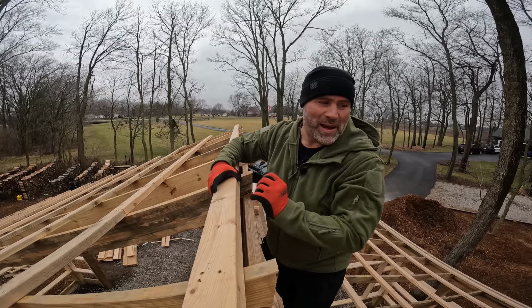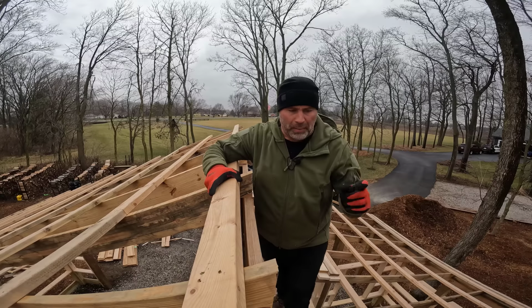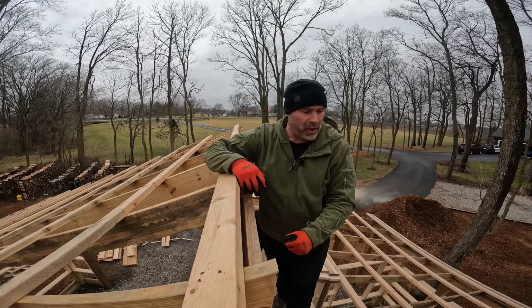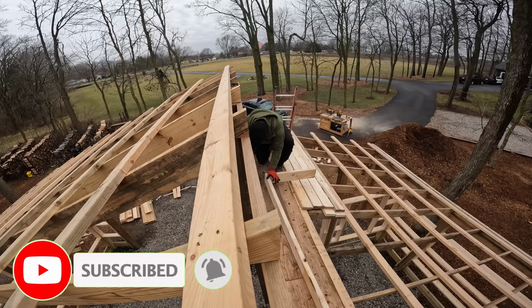Okay, I wanted to switch things up. I'm getting sick of building walls down lower, and I'm running out of lumber too. So I'm coming up top. I'm gonna frame the windows in up here. Long story short, what I'm gonna do is mark center in each one of these cavities, and then I'm framing out 4 boxes.